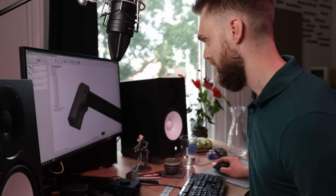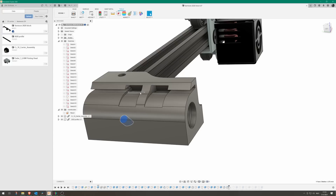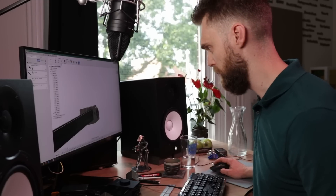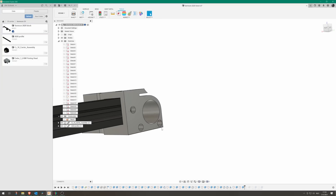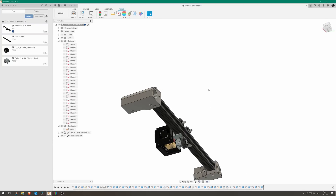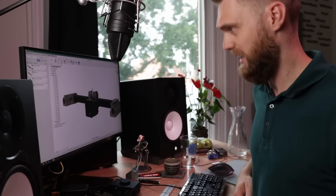I added this 45-degree angle and added two fillets — it's a cool effect. I added two holes here for the timing belt. All these features, like the holes for the timing belt and the holes to keep this 2020 profile in place, are all mirrored using the mirror function. From this point onward we have some specific features: the motor mount is also placed on here — it's a bit close to the edge but it's printable. And on the other side, the hole for the pulley. As we speak, I am printing this out of ABS on my giant printer. Once the print is finished, I'm going to put everything together and make a sick-looking montage sequence.